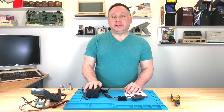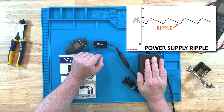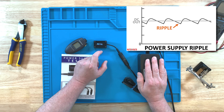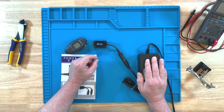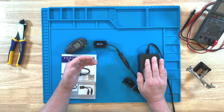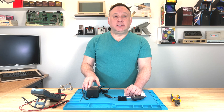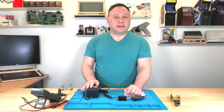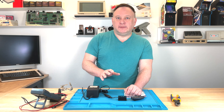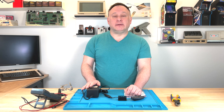Obviously, showing you how your power supply is actually delivering 5 volts is nice. On top of that, the ripple value is the variation in the DC voltage within your power supply, which has been derived from your AC wall socket. This one is showing a ripple value of 0.01 volts. Technically speaking, any ripple in the DC power is due to incomplete suppression of the alternating waveform — converting the waves of AC to just the flat line of DC. This information is good to see how well your power supply is converting from AC to DC, taking 120-volt AC from the wall and converting it to 5-volt DC, changing both the voltage and the waveform type.